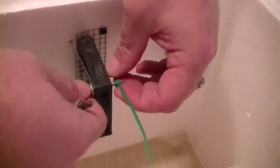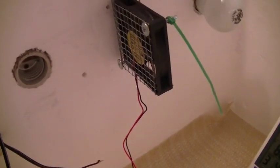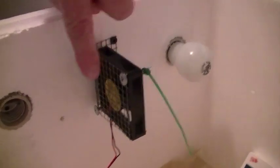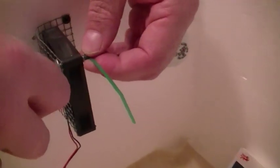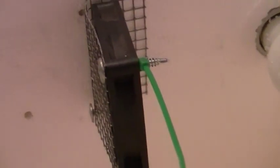I was talking about using the zip ties or wire ties as a nylon nut. You got just a standard bolt mounting your fan or mounting anything. This hardware cloth — I made a bracket out of it, 90 degree, to hold this fan in the middle of the box. Works really good. Hardware cloth is a good multipurpose material. It's got all these little small holes that you can use for bolt holes all through it. But you zip your wire tie down on the end of your bolt right here, and just screw it on like you normally would with a regular nut. And when it snugs up, you got it. Then you just snip off your tag, and it's fastened.